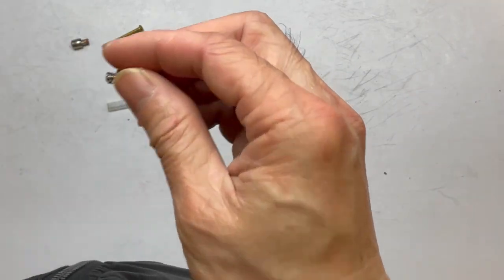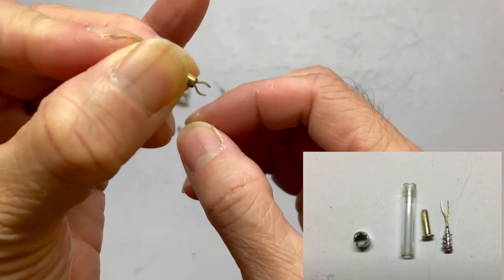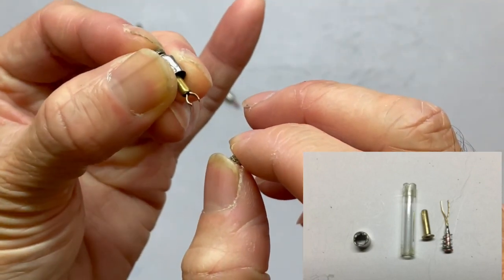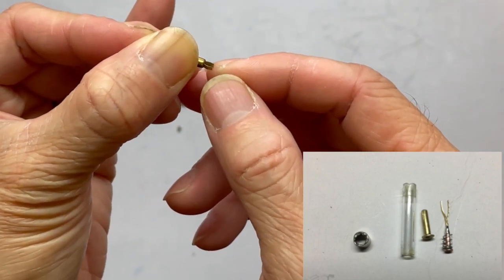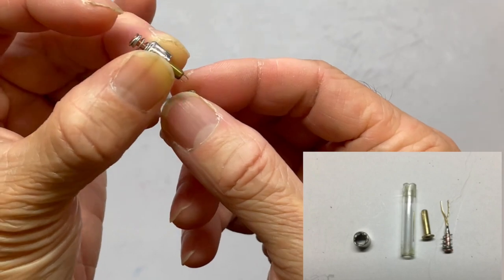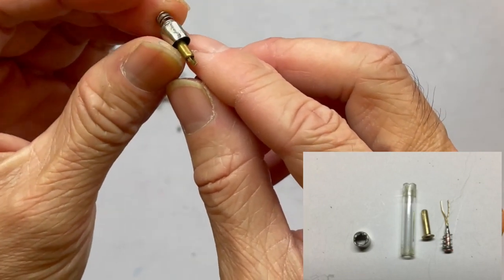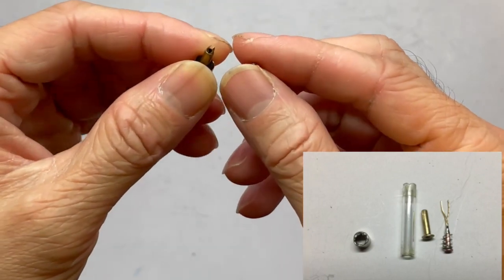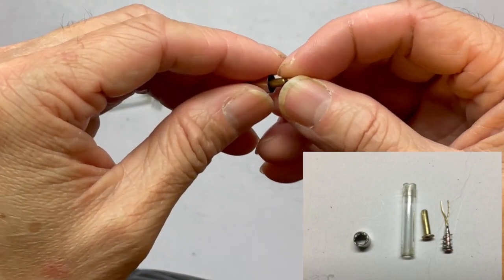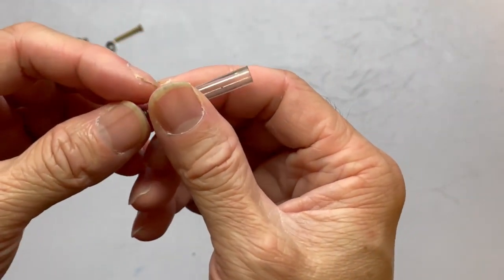For the crystal holder, it's a bit more complex. I have a small clamp like this — another spring here and a copper nail connecting to two pieces of copper plates that I cut out that look like a claw. I then pass through a small copper tube. Because the spring is loaded, it can work like a clamp, so you can cut your crystal into small pieces that can fit within the glass tip of a fuse tube like this one, and then put it in.